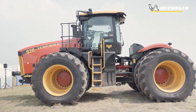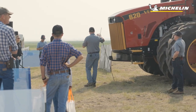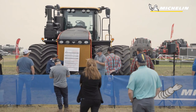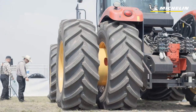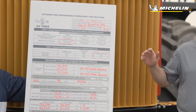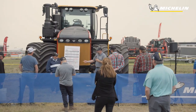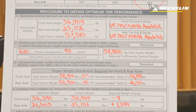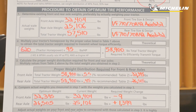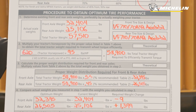How do we make sure your tractor is set up efficiently to transmit that horsepower into the ground? On this machine — the Versatile 620 — we're going to say we're doing field operations at six miles per hour, so that's what we're ballasting for. Your speed in the field determines how much weight we need. For a four-wheel-drive tractor like this, we want to target about 95 pounds per engine horsepower, split 55% on the front axle and 45% on the rear, to make sure those front tires are really pulling and engaging well.